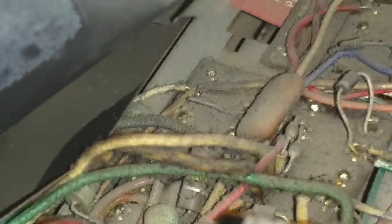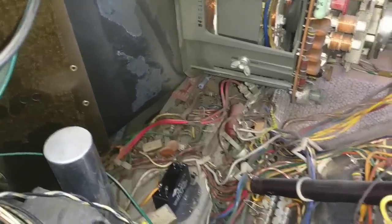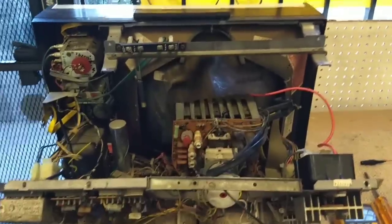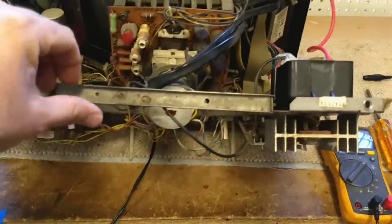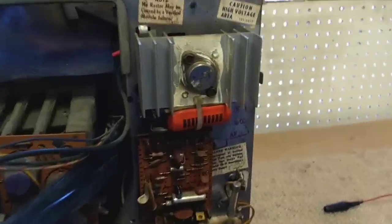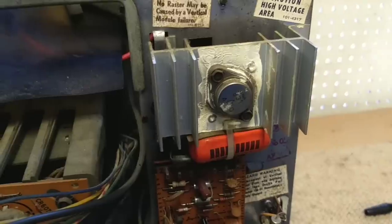So, something else is going on here in the high-voltage circuit, not sure what. And you see these two leads down here that are sticking up? That's where the degaussing thermistor used to be, so it obviously broke apart, and that's why we don't have a degauss anymore. But I didn't see it rolling around in the set, so it's caught somewhere or whatnot. So, yay, more fun there. Alright, so, checking everything nominally, all the voltages in the B-section are stable and everything, so, we've got some high-voltage issues, which are preventing proper regulation, and I'm hoping it's not the new tripler that I installed. Although, anything's possible, NTE isn't the greatest thing. Somebody's put the four-lead safety cap in there, not sure if that's the correct part, or if it's not, could cause the problem. Also, the horizontal output transistor isn't really correct for this circuit, so that could be part of it, too.